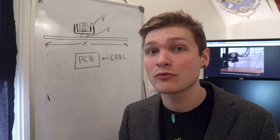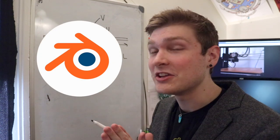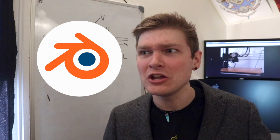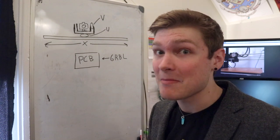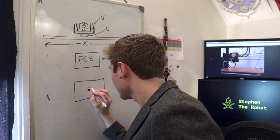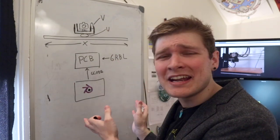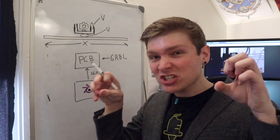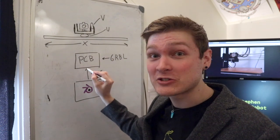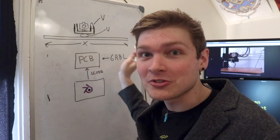I'm gonna cheat a little bit and use an existing piece of software called Blender. Blender is the scariest piece of software I've ever seen — not because it's bad or weird, but just because it's intimidating. It can do everything: video games, video editing, animations, rigging. So I'm gonna learn Blender, animate exactly how I want the camera to move, then write a script in Python that extracts all the coordinate points during the animation and writes G-code from that. Then I take that G-code, send it to my circuit board running GRBL, and it controls all the axes.